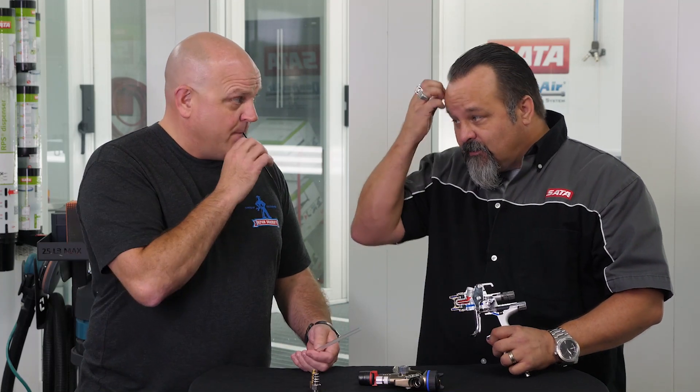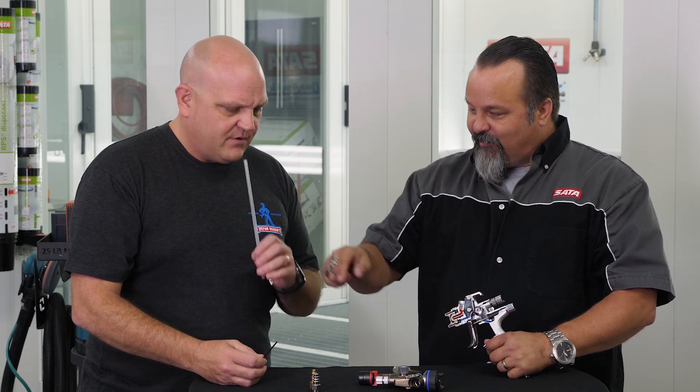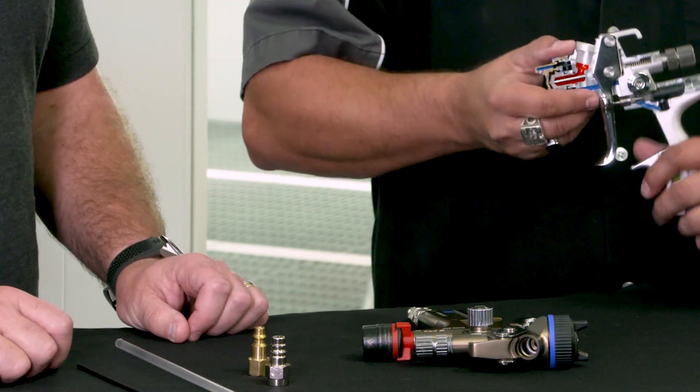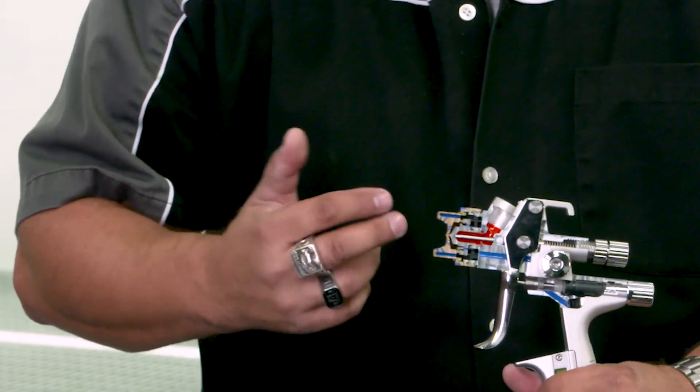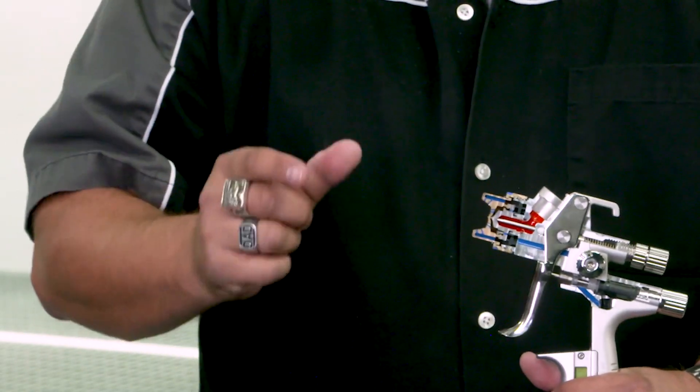To get the volume needed through that tiny hole, the air has to travel with much higher velocity — kind of like these straws. If you try to breathe through the tiny straw you have to suck air through it a lot faster; with the bigger one you can breathe normally. With the spray gun, when velocity comes up it shoots air through the horns and the holes in the air cap, which are there to atomize the paint and form a proper spray fan. If you're blowing air through with too much velocity, it blows streams of air through the paint and leaves little bands of color coming off that fan — visible in your test pattern.